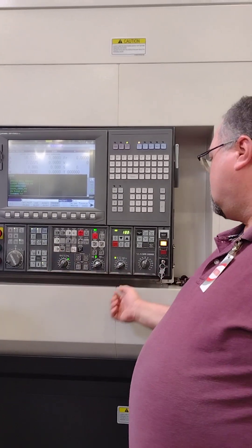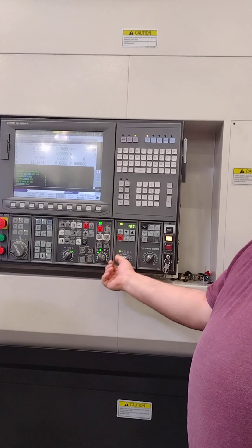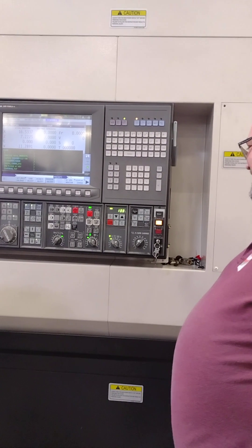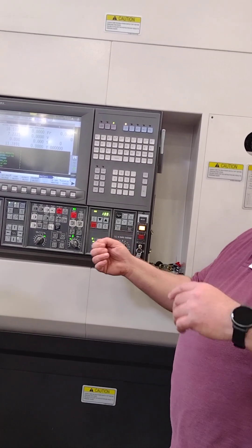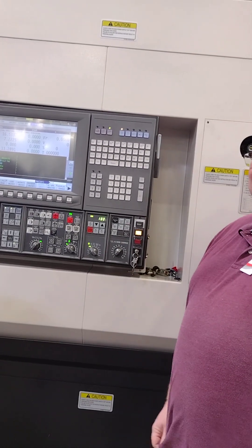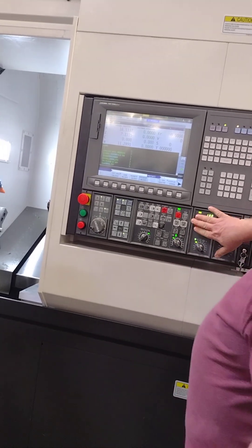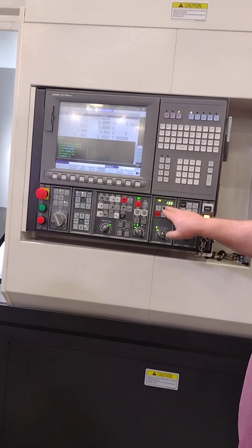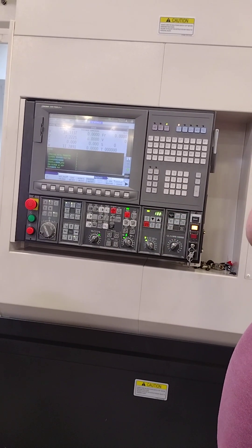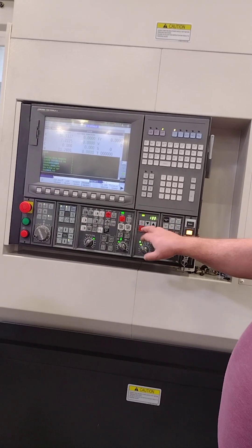This is your feed rate, and rapid is over here. In between, you have your spindle one and spindle two. Nice little green light when it shows up at 100. Back when I was a machinist, somebody wanted to do a time study — take the knob off and move it a little bit so it looked like 80% was 100. This is your M spindle control. You want to slow down or speed up your M spindle RPMs. You could override it in auto — you're running in auto, you hear it cutting rough, and you can bump this up to change the RPMs. Jog clockwise, counterclockwise, and stop. You don't have a locking M spindle.